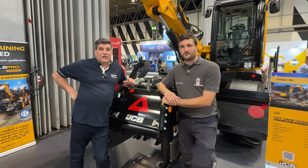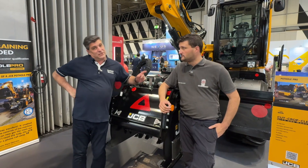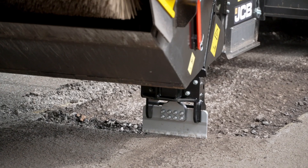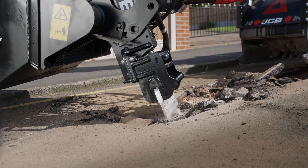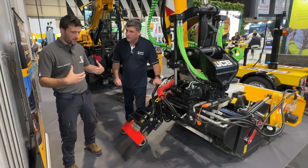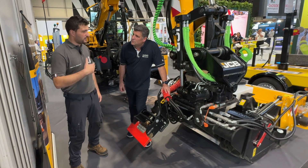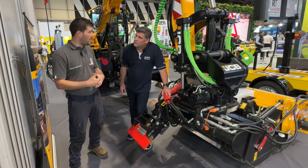That's really important, but it's also important that we are sustainable in the way we do things. Come round here. So what we've got here is the cropping tool — the really important part of the process. It's like a hydraulic breaker, where traditionally it would be a breaker with all that hand-arm vibration. That's all done from the luxury of the cab, just pressing two buttons, and then you can crop and get that clean cut edge. Every repair, to make it last, is all about that clean, crisp edge — your tarmac can butt straight up to it. And that gives you the permanent repair, all from the luxury of the cab.